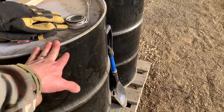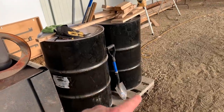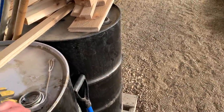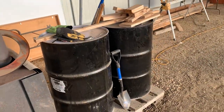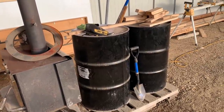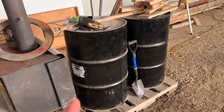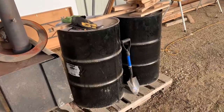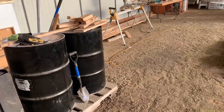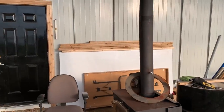I have 50 food-grade black steel drums filled with water as a test for this year. I have a temperature probe in there to see what temperature the water is getting, and I'm getting 76-ish Fahrenheit on a warm day — about 24 or 25 Celsius. That's my thermal mass. Once the concrete is in, these are going two layers high along the entire back wall of the greenhouse.